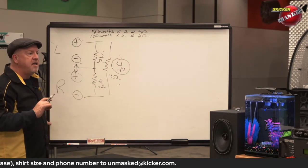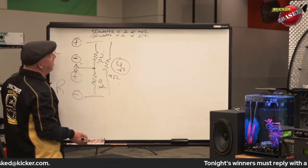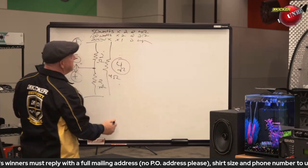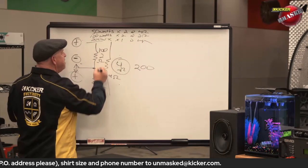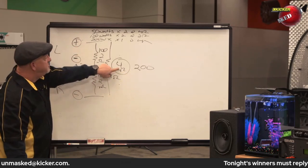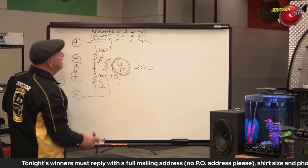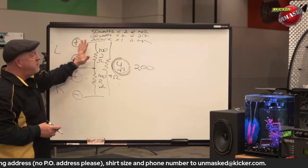The amplifier does not care which is which — it works exactly the same way. If this amplifier does 200 watts by one at four ohms, that's exactly what it does. We've got 200 watts total, which means each channel is doing 100 watts. 100 watts and 100 watts gives you the 200 watts; two ohms and two ohms gives you the four ohms. When you bridge an amplifier, the total impedance is always double what the stereo impedance is. That's where the power comes from.